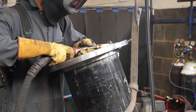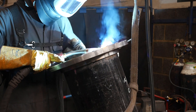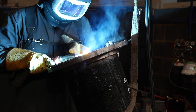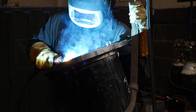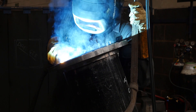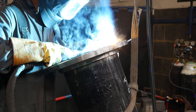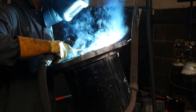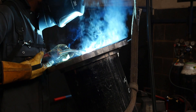Now I can take the pipe off, use the crane, and then weld the flanges. These flanges are welded at around 250 amps, and you can see the amount of smoke that is pouring from the flanges into my face, which is why I use the Speed Glass G501 welding mask — because there's no amount of holding your breath that will stop you from breathing in all this poison. One run is always needed inside these flanges, and the pulse on the MIG welder takes care of these nicely.